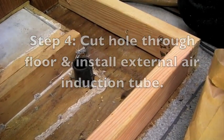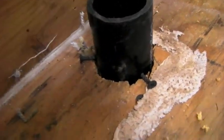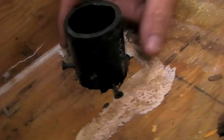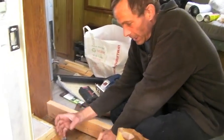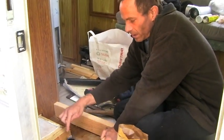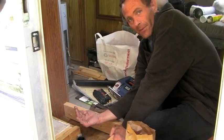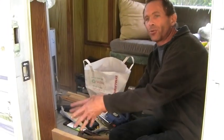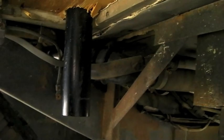If we put in an air inlet in a really small space like a motorhome or a boat, you really don't want the option of depleting all the oxygen in the unit with the burning of the wood. So this two-inch piece of ABS pipe will just drop down below the rig and come up — we cut a hole in the subfloor here so air is allowed at the base of the fireplace. That way it's consuming its oxygen from outside — smart and safe.